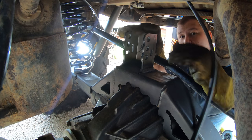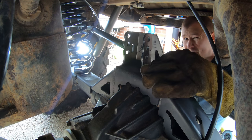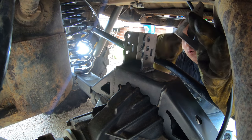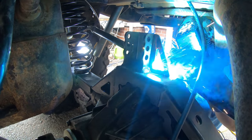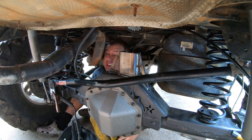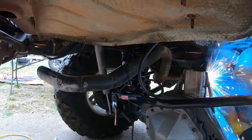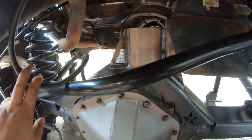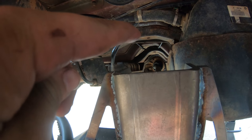The reason I welded the bracket on without the gussets is so I can make a continuous straight weld without having to go around them. That also means I'm going to have to notch the corner of the gusset so it fits around the weld we just made. Finally, the upper link mount is burned in — looks pretty good and it's perfectly centered with where we're going to mount the upper link mount on the frame.